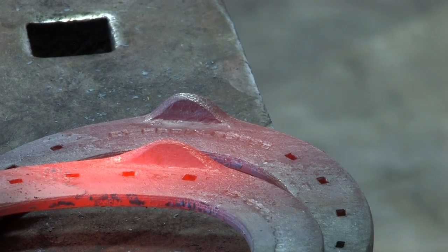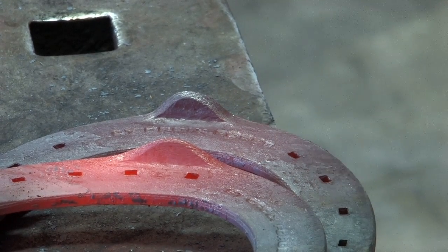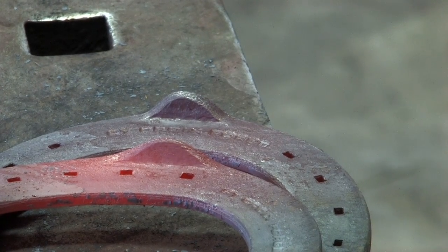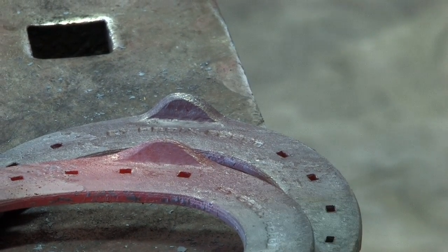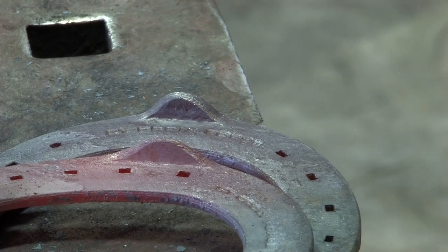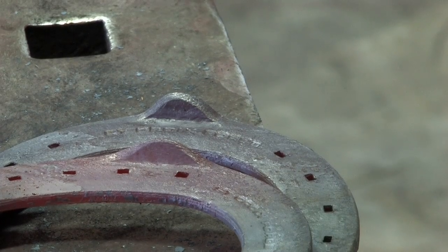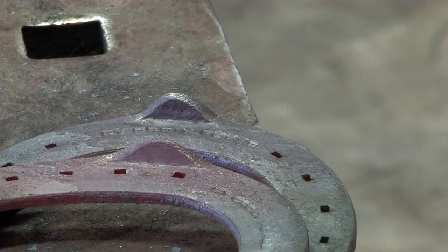When I look at these two clips — the hammer clip and the bob punch clip — with the hammer clip, all the source material started from one position. With the bob punch, we've had to bob punch it and then set the clip to get to the same point. We have to take the bob punch clip to this point before we draw it. Many people skip this step and try to draw the clip right away, ending up with a very thin clip.